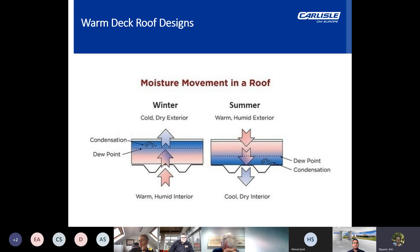This air will likely be warm and of a high moisture content. So once inside, it will become trapped, naturally migrating to the underside of the top waterproofing membrane layer, where it will cause mold growth, reduce the effectiveness of the insulation, and if there is any timber in the warm roof layers, will cause this to rot very quickly.